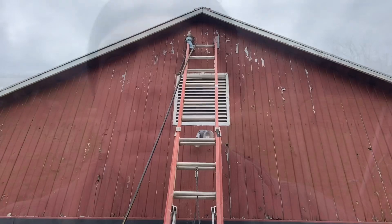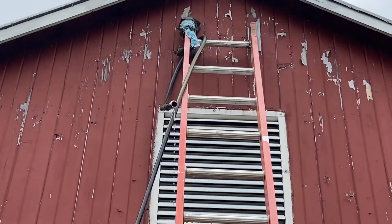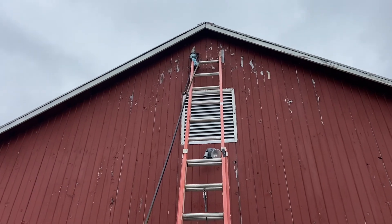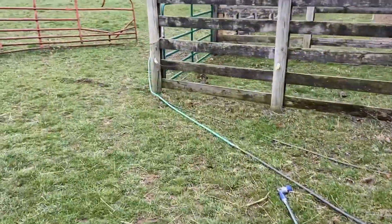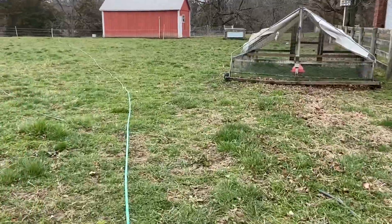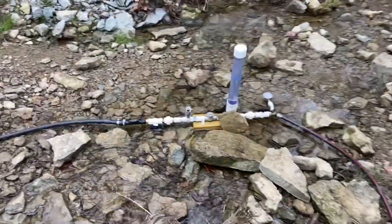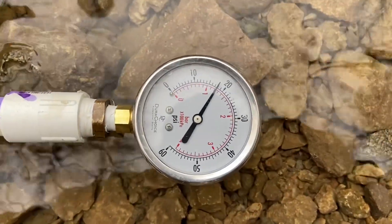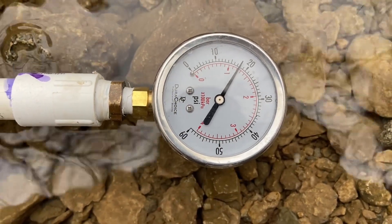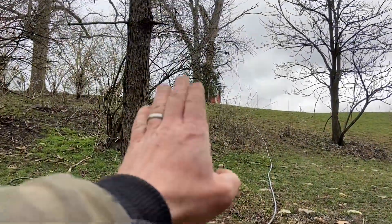That's about all I've got there — just about the peak of the barn — and it's still pumping. Let me show you this close up. You can see I got the hose wrapped around the top and it's draining out there. Definitely still pumping with pretty good flow. That hose is running clear down here, 350 feet down into the creek bed. So 18 PSI times 2.31 is 41 and a half feet — 41 and a half feet of height that we're pumping up. Just incredible.